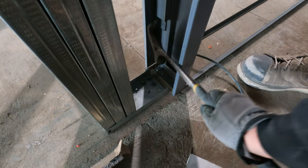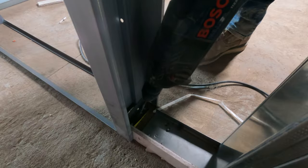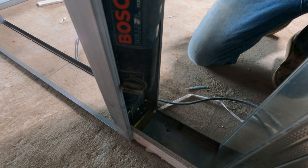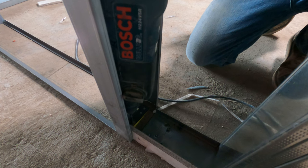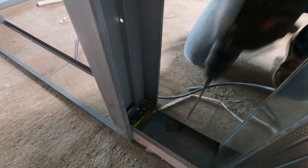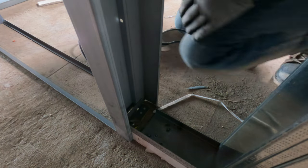I'm hammering one pin in on each side. It's really easy — just put your bottom spacer like this to make sure your drywall will fit, because your walls are already level, already lasered in. You just have to make sure now that your drywall is going to go in. The doors should be set to the drywall thickness specified on the drawings and the wall size — simple as that.